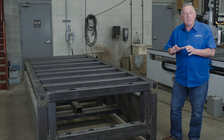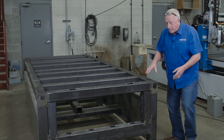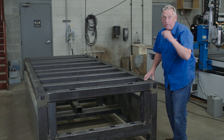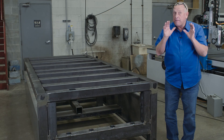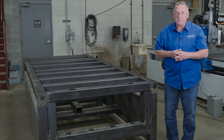This machine gets a vacuum table, and let me show you how we incorporated that into the frame design. There's basically a large manifold that's a frame member, and that manifold has large vacuum ports on top. But if you think those are large, you should see the port on the back that connects to the vacuum pump. Having a great vacuum pump is one thing, but you still have to get the vacuum to the part, and nobody beats a ShopSaber design.